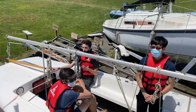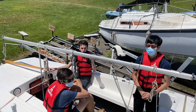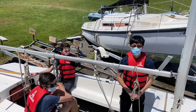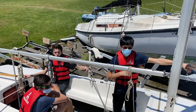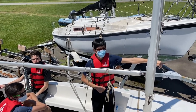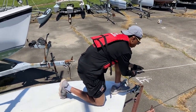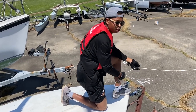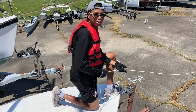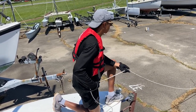We will be raising the anchor. I will be motoring towards the anchor so they don't have to try as hard to pull it up — they won't have to pull the boat while we're going toward it. My assistant will be pointing towards the rode to make sure it does not wrap around the keel while I'm motoring towards it and while he's pulling it up. I have gloves on just in case any foreign objects are on the line or any jellyfish get stuck on it, so I don't get stung or poked.